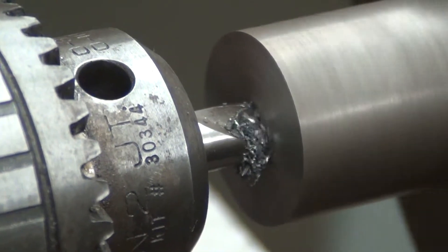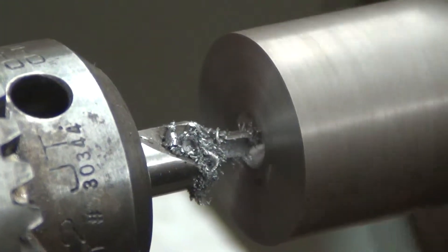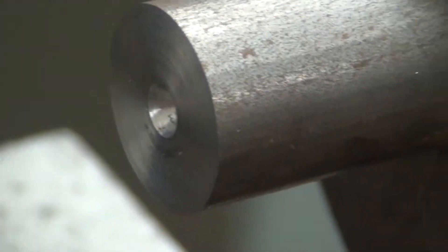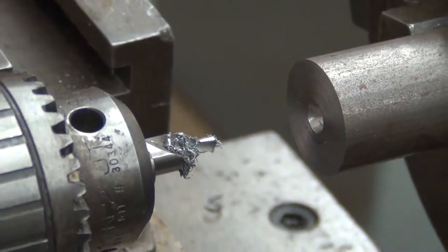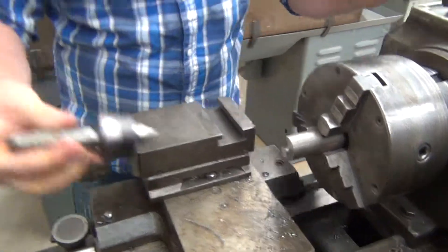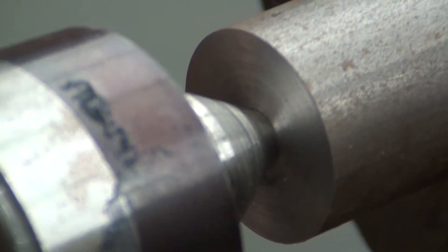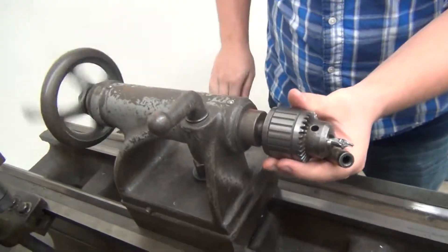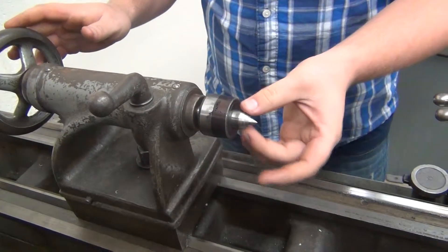Keep going a little bit more. Once you start to get close to the flat spot on the bit, you need to stop. Bring it out and turn this off. Now you can see I have an angled countersunk hole into the end of my piece, and it should be on the same exact angle as my live center. So when my live center fits in here, it fits nice and snug directly in the center. Now I need to change out my chuck — I'll spin it all the way back and it'll pop out, then I can feed my live center in.